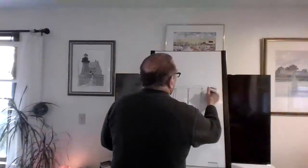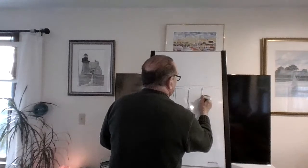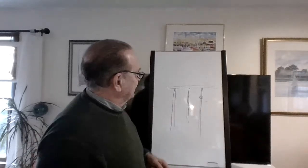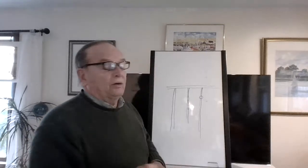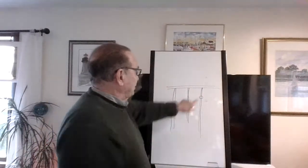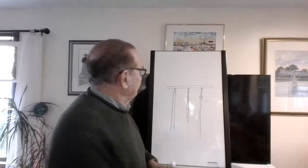Okay, so we'll say upstairs. I won't even draw the upstairs. Let's say you've got to put the water closet right there, perfectly centered. Murphy's Law. If something can go wrong, it does. It's going to be right on the center beam, 2x10. Doesn't matter the size. You can get an offset flange, and that will kick to the side like that. But you're still going to take a big piece out of that floor joist. So what do you do?